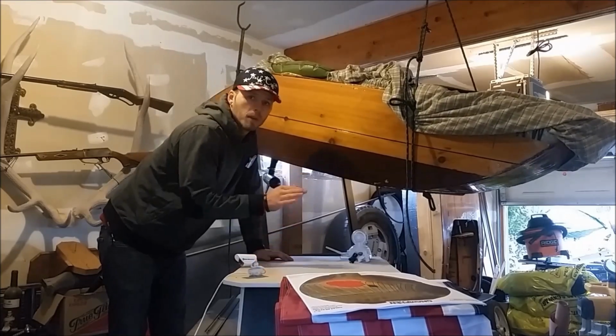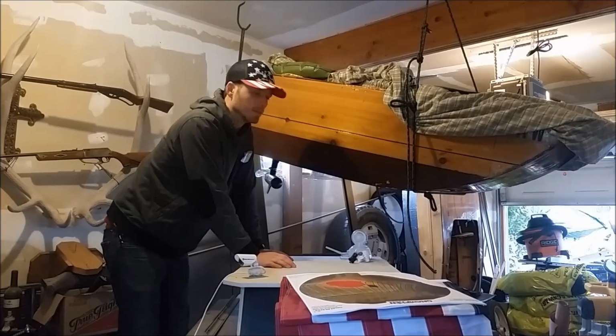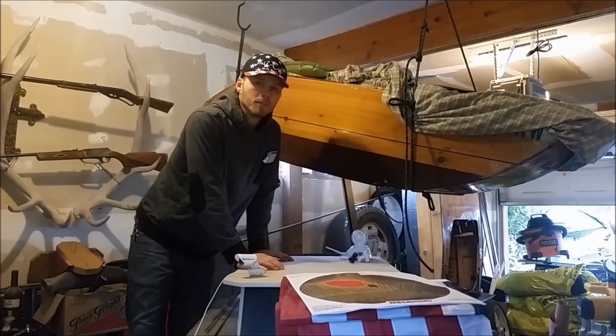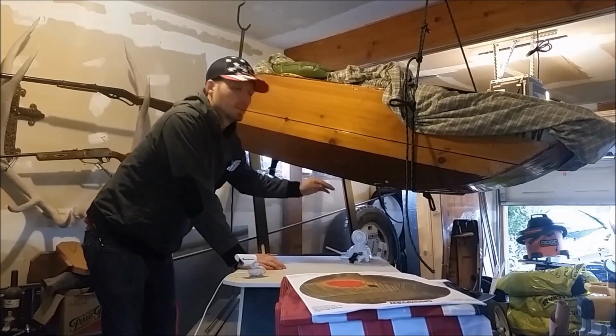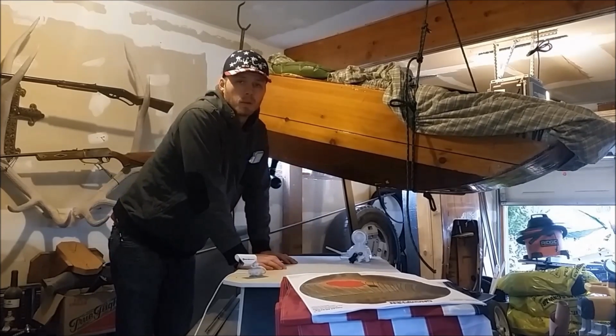By the way, all of my boats are flat bottom. It makes it 10 times easier than building a V, makes it twice as fast. And you don't need a V unless you're going to get on plane. The only thing a V will do is raise your center of gravity once again and add complexity to the boat.